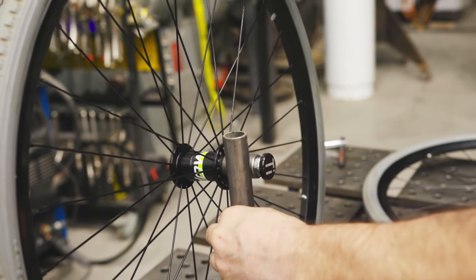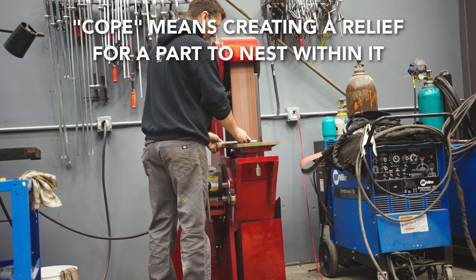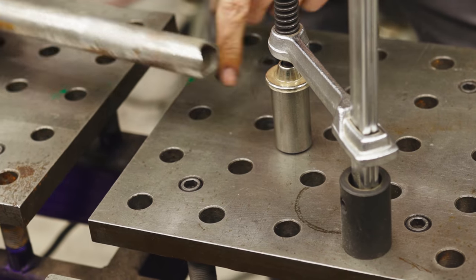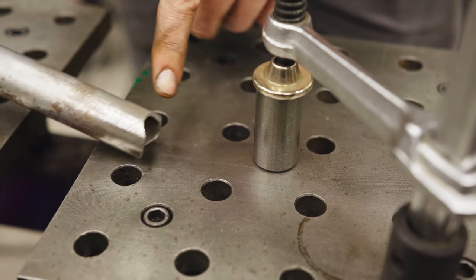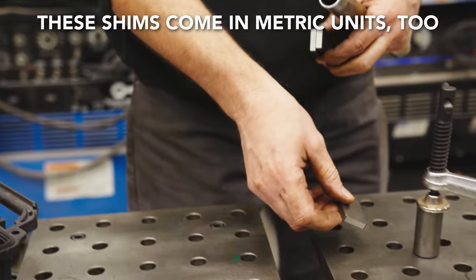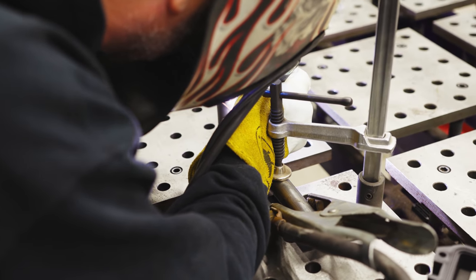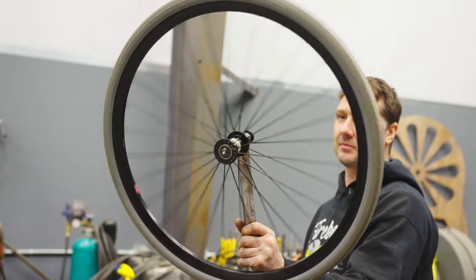I want to make a drop — something that's going to lower the elevation and hang this boot from this point. So I need to cut this to length, cope it, and weld it to this bushing. This clamp is going to hold that part flat to the table because we have a machined surface, and I want this tube to be a quarter of an inch from the edge. I'm using shims for height — probably the most used tool here in the shop. Now I know that's going to be nice and square. Axle goes in there like that — boom, got ourselves an attachment point.